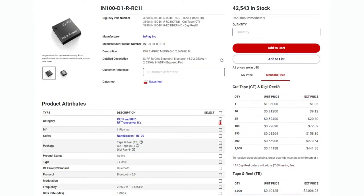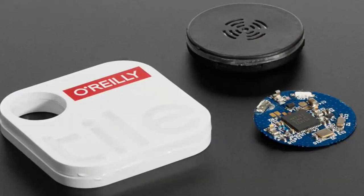Here's the good news: because it's so simple — no flash, no outputs, can't receive data — it's really, really, really cheap. 40 cents cheap. That's ridiculously cheap for a configurable Bluetooth transmission device that's well designed with peripherals like ADC and I2C controller built in. It's great for sensor beacons — little things that just send a beep with their identifier or temperature every N seconds. They might be disposable; they just need to be very low cost. Your whole bill of materials can easily be a dollar.